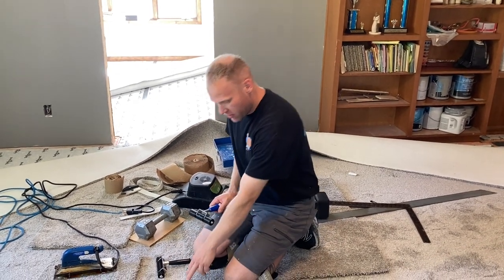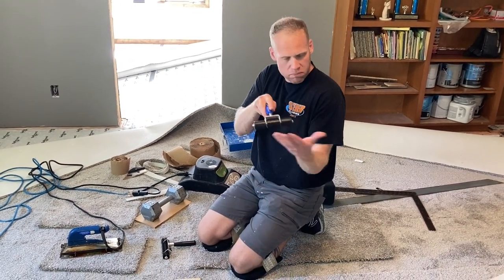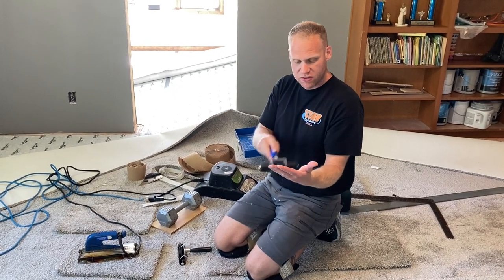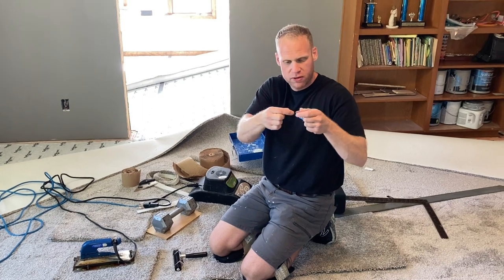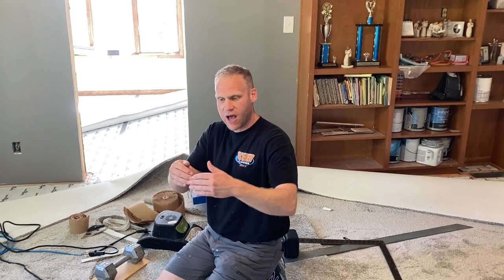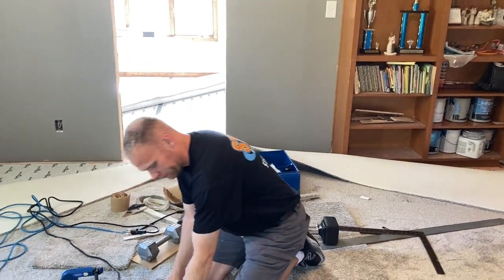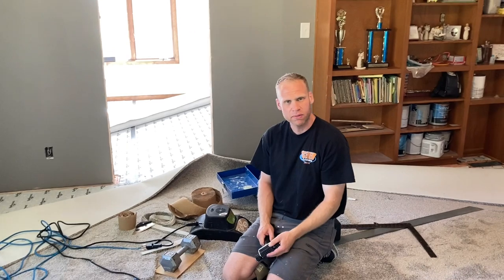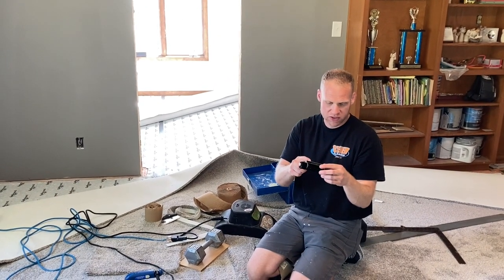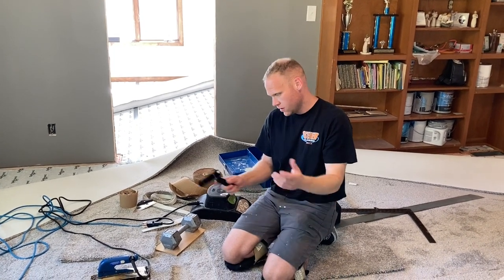But when I would have my smooth roller, and I'd be going to roll the adhesive, sometimes I'm probably pushing too hard. And what it does is it pushes that adhesive forward or backwards and it creates that ball of adhesive or just a direct line of adhesive. Now, if you're using a real low nap carpet, you will see that in the carpet. Everywhere the seam iron stopped, it looks like a puddle of the thermoplastic adhesive on the seam tape. And so I found with this paddle roller, with the space in between there, it's not having that constant pressure on that seam. So let's go ahead and burn a seam.